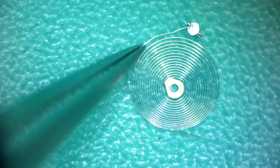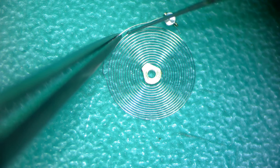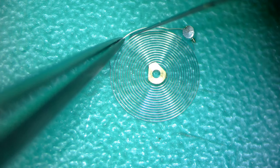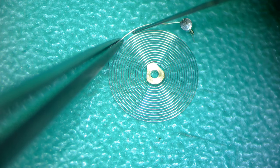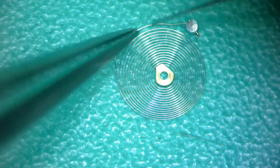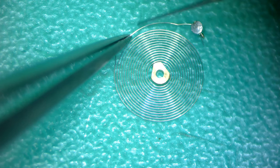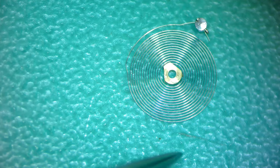This is all going to be one shot, completely unedited. This is not a very involved hairspring repair, but any hairspring repair is delicate. Using my finest tip tweezers and my finest oiler, I'm massaging the hairspring in the direction I want it to go — very, very lightly, almost as light as I can possibly do it. What I'm trying to do is make the gap between the terminal curve and the coil just inside of it even all the way across. I started to get comfortable with it — it was starting to look better — then I went too far and over-corrected. That last adjustment got it pretty close.